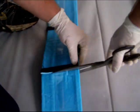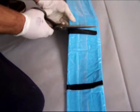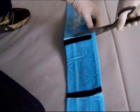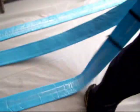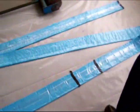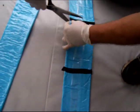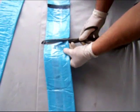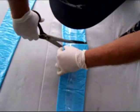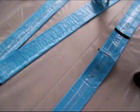For start and stop lining, we have to make cutouts in our liner. Traditionally, with our regular wet out, we have to be very careful with cutting into the liner as to not damage the release plastic or the bladder. In this case, there is no bladder or release plastic inside the liner. We want to cut through about 75% of the liner, leaving a 1-inch strip in the middle to hold the liner together while we invert the plastic through.